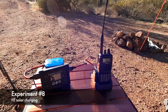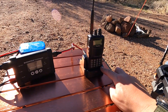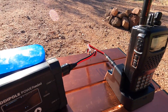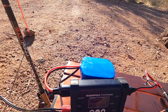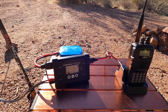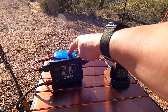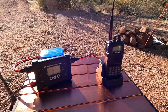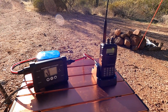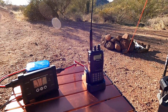I'm out here, nothing else to do, just waiting for the sun to come down so I can set up my tent, start a fire, have some dinner, and enjoy some coffee. Here's another little experiment: I have my Yaesu FT-60R HT sitting in the cradle, and I made a small cable at home so I can actually charge it from the Buddipole Power Mini through the battery pack, which is topped off with solar. I'm looking at the meter — it's indicating float, which means I basically have a full 4.5 amp-hour charge on this battery, and I'm still producing enough solar even at 5 PM local time, pulling about 500 milliamps. A great option for anybody looking to recharge their devices in the field.